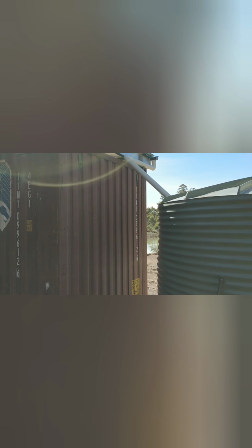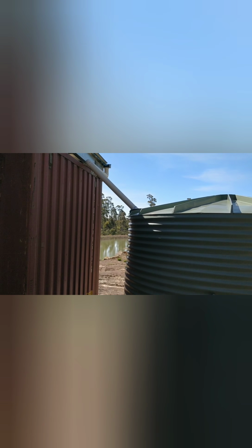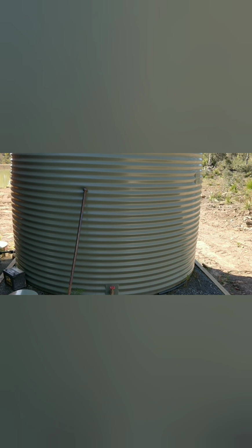The roof there, the span between the two shipping containers on the inside is 5.8 metres, and a shipping container is 12.1 metres long, plus the width of each shipping container, which is around 2.35 metres. I'll leave it as an exercise to the reader to do the maths to see how much roof area I have. That drains down into a 14,100 litre tank bedded on dust.